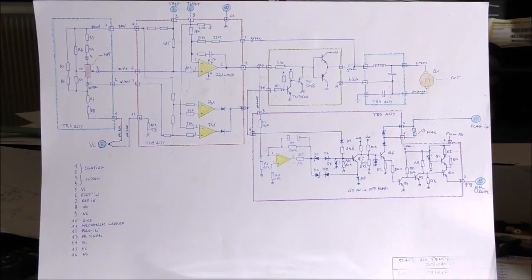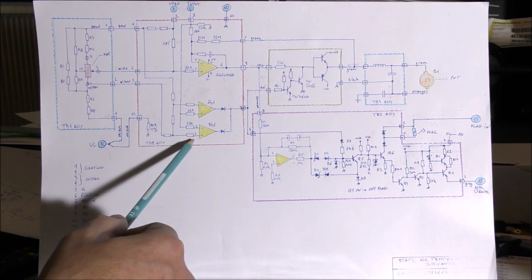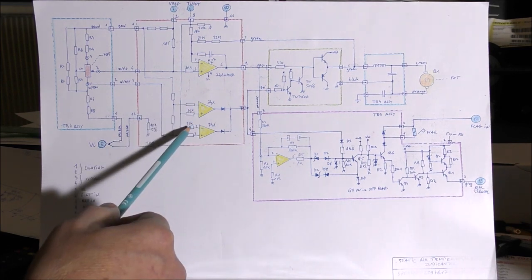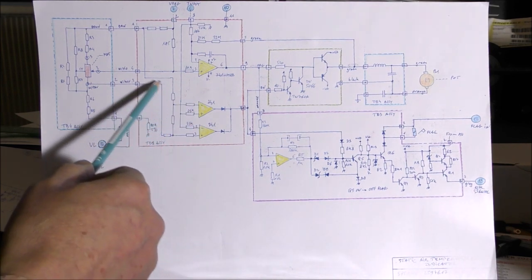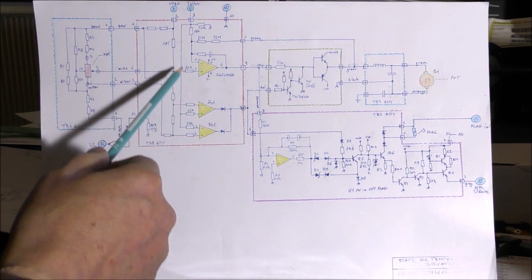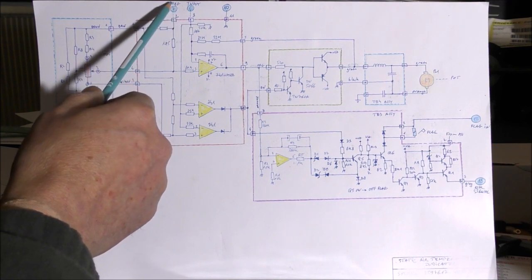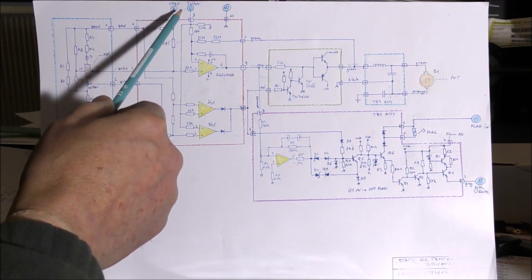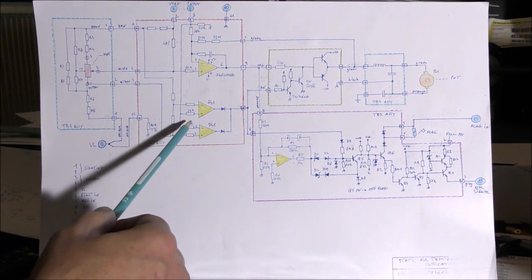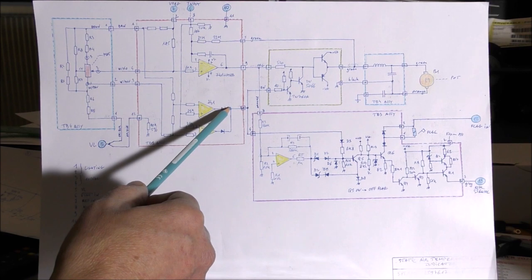There is also a validity test of the input voltage. The input voltage is fed to these two comparators. The threshold voltages are of course proportional to the reference voltage. So this permits to have something which doesn't depend on the reference voltage, because input voltage is also proportional to the voltage reference. This is done inside the air data computer. If the input voltage is outside the limit, therefore there will be a high level at the output of this OR gate here.